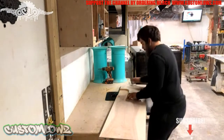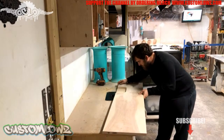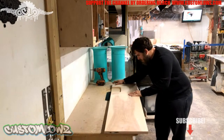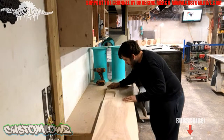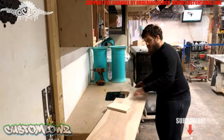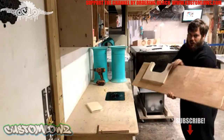All right, so I'm going to take my flush trim bit, which I already have set up in the router, ready to go, and I'm going to copy my first cutout. So now I got two pieces, and this is now going to be my template for the other two. Well, the other two notches that I got to do.